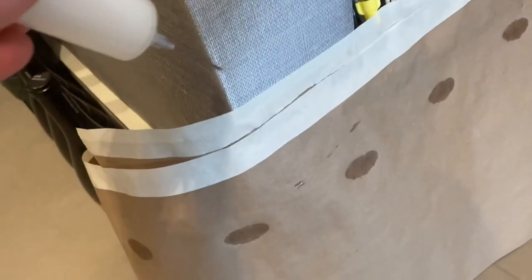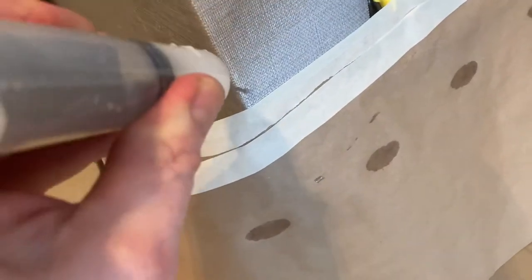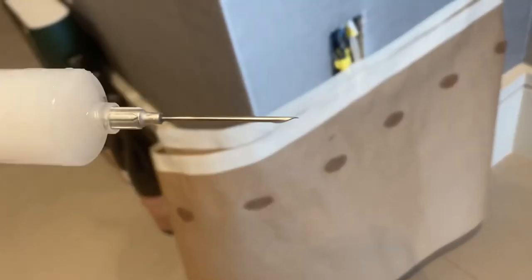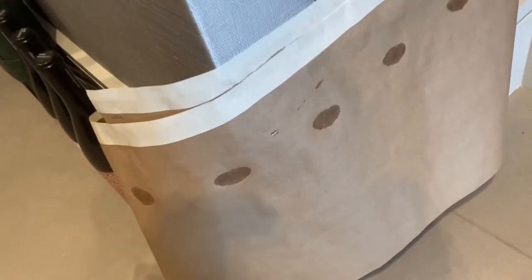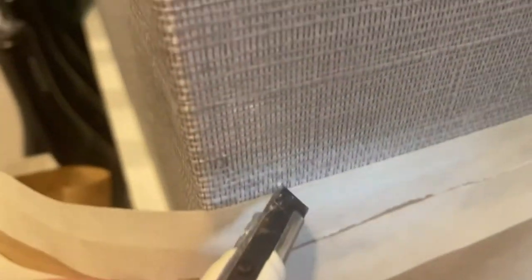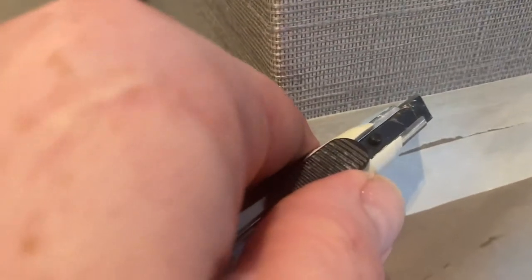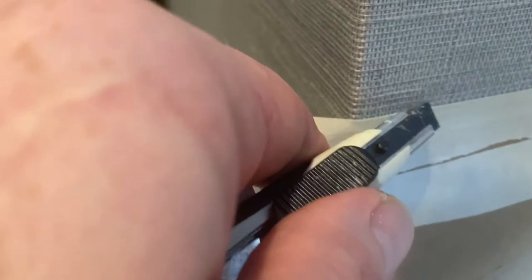So let's talk about getting the job done and working with these irregular angles. You can wrap grass cloth around a 90, an 88, or a 92. But once it starts going up to 95, 96 degrees, or much below 90, you're causing a very stiff wall covering to start bending, almost like asking it to bend in a figure eight. It doesn't do that.